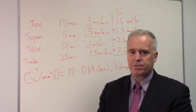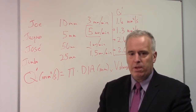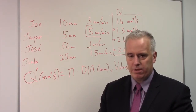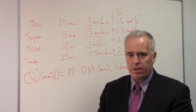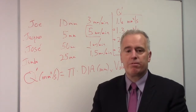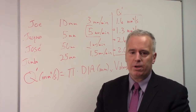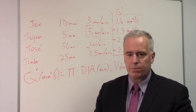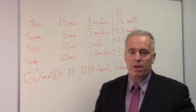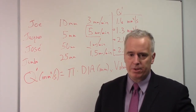What I encourage my customers to do in my high-intensity grinding course or in my boot camps is to pick a Q prime that's respectable, do a survey of what you're doing in the factory on your roughing operations, and say, 'We're going to go at a Q prime of 3.' Then get everyone in that ballpark of 3. They know their workpiece diameter, they choose their plunge speed to give a Q prime of 3, and that gives more consistent results, more consistent productivity — a better measure of productivity.